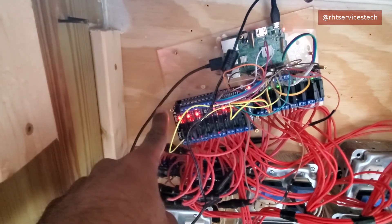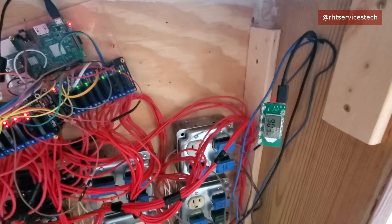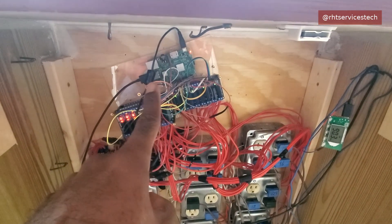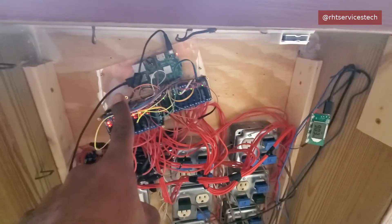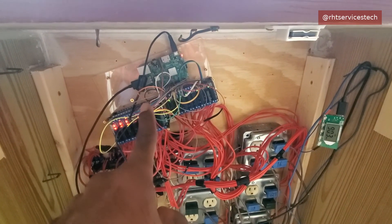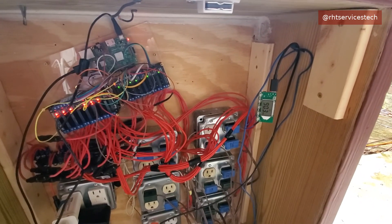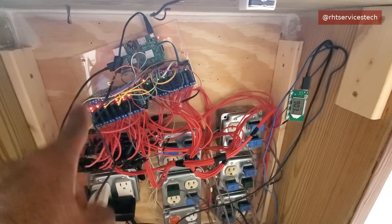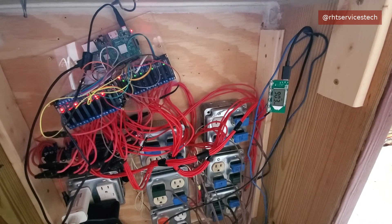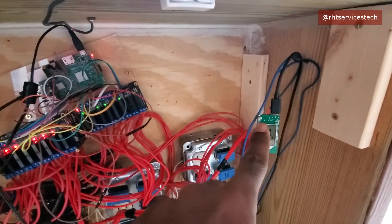Also off the Raspberry Pi you have this cord here, which handles data transfer and power supply for the FM transmitter. A lot of people say you need a sound blaster card, but with this particular setup you don't. What you do is plug your FM transmitter into one of the USB ports on the Raspberry Pi, then go into Falcon Pi Player where the audio output is and select FM transmitter — it will show the model number and say FM transmitter. That sends the audio out of the USB to the FM transmitter. You don't get static, white noise, or other issues you might get using the audio jack on the Raspberry Pi.